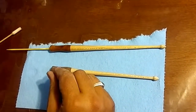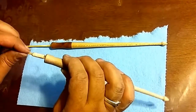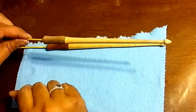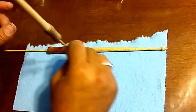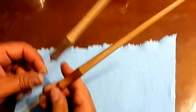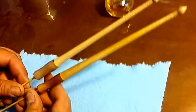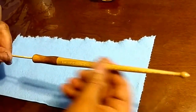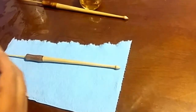The way that I do this is I take a little skewer with some tape on it, and I just stick it inside there. And then if I'm building several of these, I've got a board with holes drilled in it, and I can just set them all in there. Now I thought I would show you this. This is a piece of sycamore that's got that lacquer on it, and a piece of cherry down here at the bottom. So we'll kind of compare with this linseed oil.